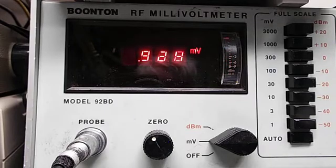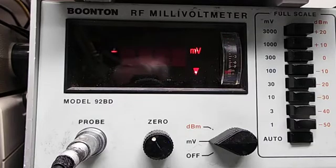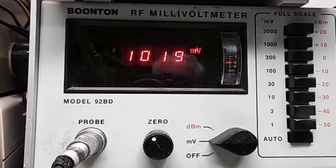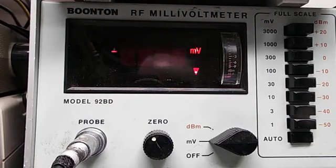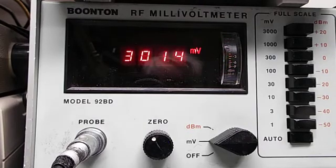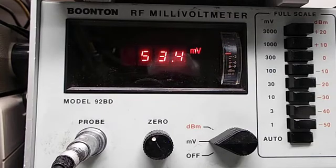Let's go up to something you're going to be measuring. There's one volt — I've got 20 millivolts difference. Back it down: 90, 80 — that's dead on. 70, 60, 50, 40, 30. It is functional, it does work. Let's take it down to 50 millivolts — it's reading 50, with me holding on to it. You can see how much noise it picks up, but that's normal. 50 millivolts isn't very much.